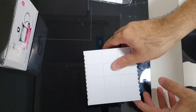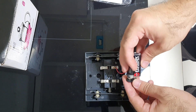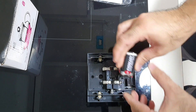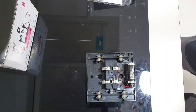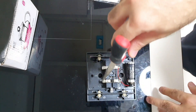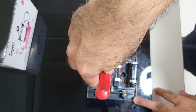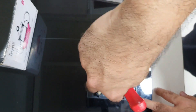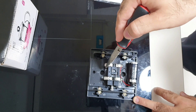So when you get your doorbell, it comes in a casing — just pull that apart, it's a small clip. This particular doorbell runs off a 9V battery, so I've got a 9V battery here and I'm going to be putting that in. Just put the battery into its case. Then come in with a pair of pliers and touch the terminals. You'll hear sound on certain terminal combinations and nothing on others. So now you know that the wires should connect those two terminals together.